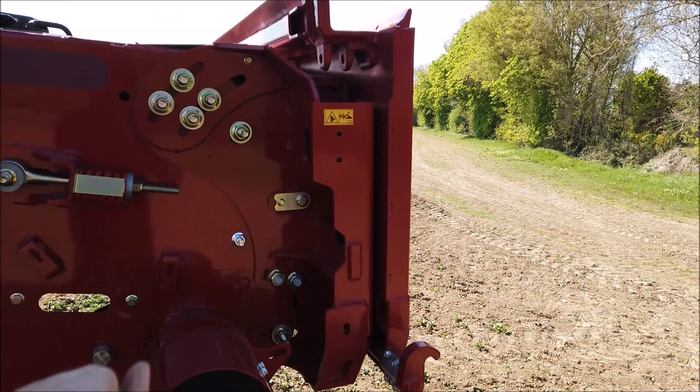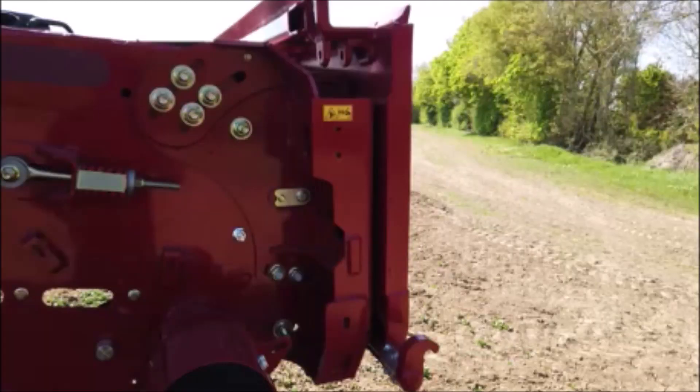At the top of the feeder is the chain drive and sprockets, immediately followed by the stone beater. The front faceplate angle is adjustable to allow the header to be matched to the combine such that the header's knife moves parallel to the ground when being moved fore and aft.